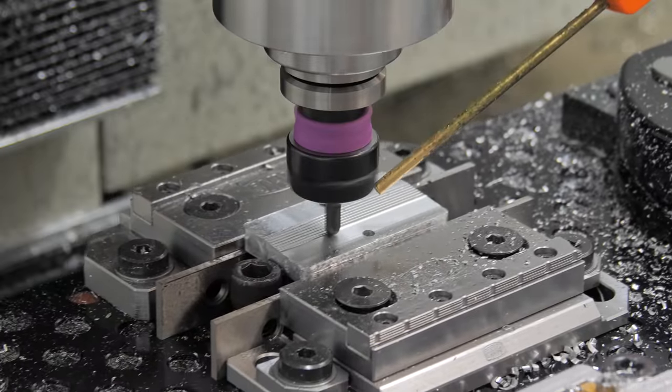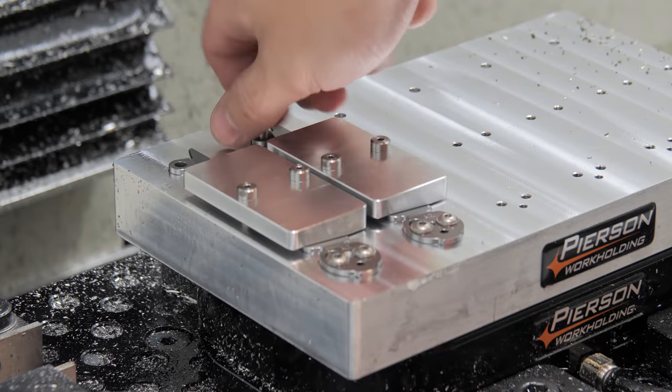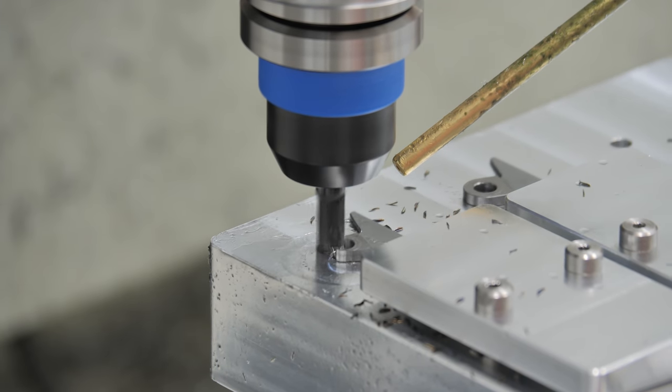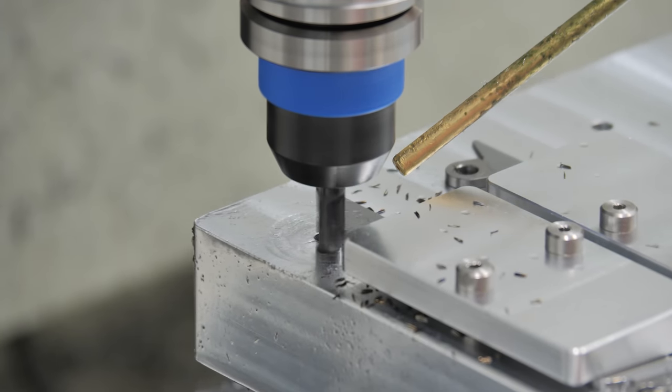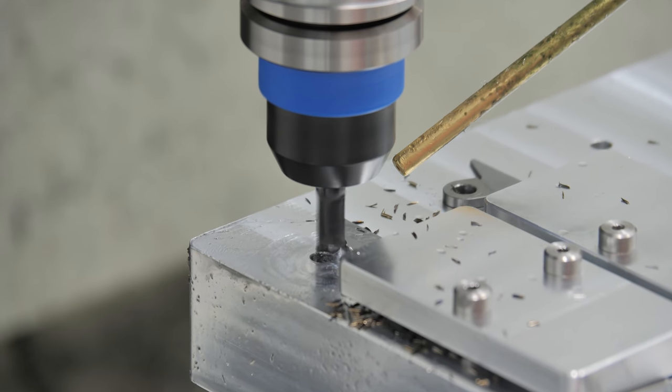Lastly, op 5, I use an angle clamp I made to hold the blade down while I mill away the tab. I had issues with vibration here. I think I should make a bigger clamp that holds further down the blade.